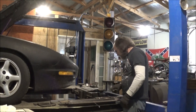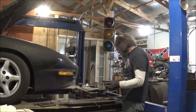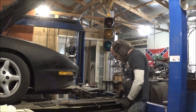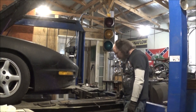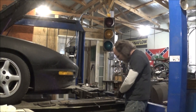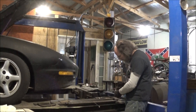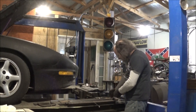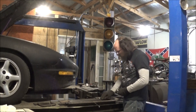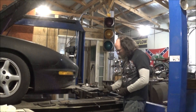I have enough room to get the metal in and out. I've got two washers here that are really thick — I'll weld one on each end. You see it's drilling some holes in this but the bolt will come up through there. There's a spring on here, and once everything's in there, tighten that spring up some. That'll always have tension pushing up on this.